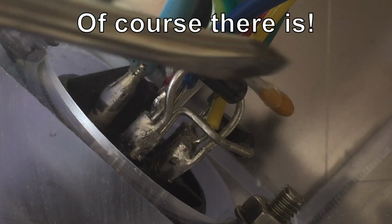Okay, I botched in the 2 diodes, the Schottkys here from ground to one signal line, and they're down below the other one from ground to signal line, and here's my 0.1 microfarad filter capacitor or decoupling capacitor on the power rail. And I didn't put my heart into it because, after studying the data sheets a little bit more in detail, I learned there is a significant difference between the 1N5819 and the 1N5817, and it's not only the rated voltage, it's also the forward voltage drop,